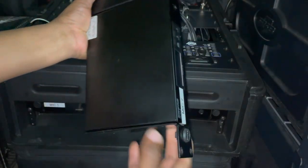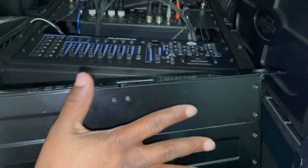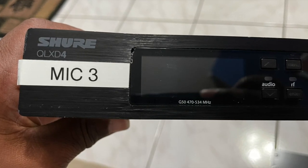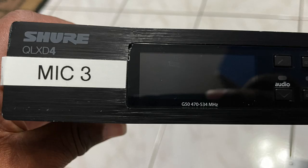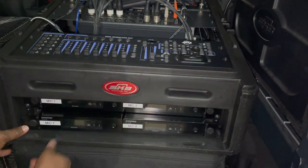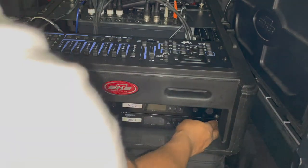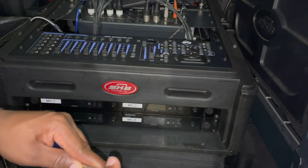The process goes like this: I use the two short ends from each system, and each system does come with a bottom plate so they join together to complete a set of two, just like that. I'm not using mic 3 here with mic 4 because mic 3 is currently at Shure — it wouldn't come on with the display. After troubleshooting and figuring out it wasn't my power issues with the antenna distro, I decided to contact Shure and send it off to get fixed. Since I have eight units I just replaced number three with number seven, and I'll use some masking tape and write number three on it temporarily. This is how simple it is to physically hook it into the box — I've got four screws to hook up, so let's time-lapse that part.